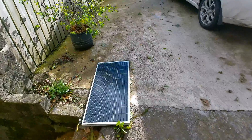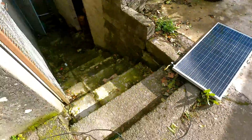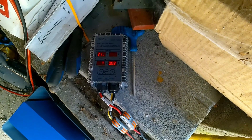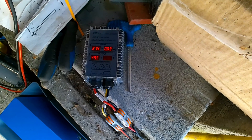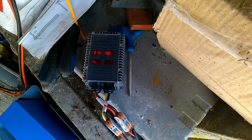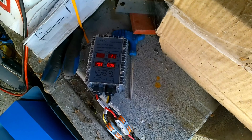Back outside now on a nice sunny afternoon. Even though the sun is splitting the trees, the voltage is way up and the amps are way down — it's basically throttling the power. It's going down to 0.04 amps, then down to 0.0. It's essentially killing all the power and keeping it steady at 49.9 volts. I'll leave it the rest of the day and then check the voltage to make sure it stays at 49.9 when measured externally.